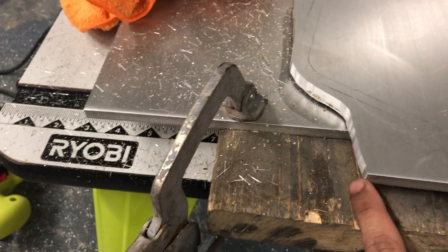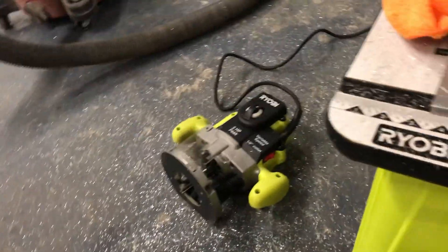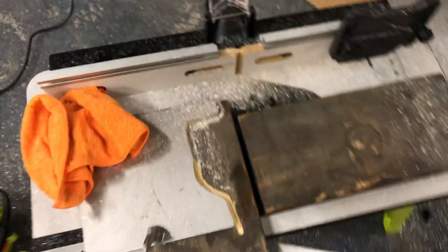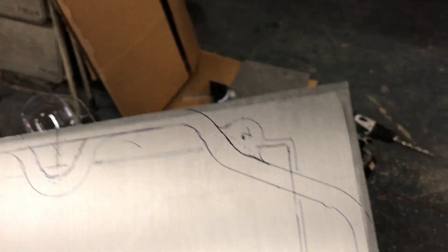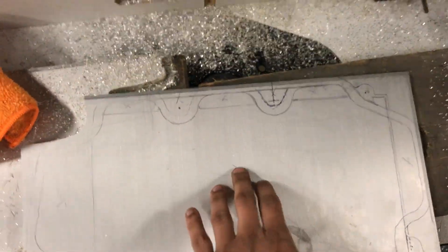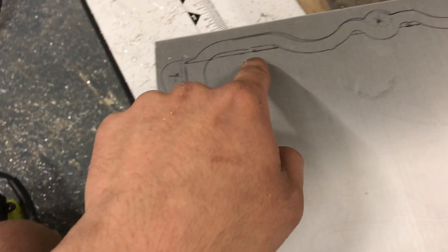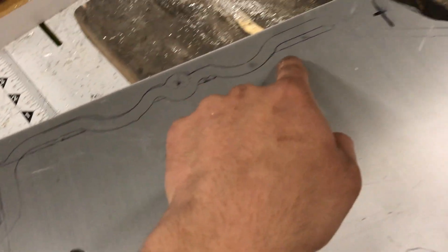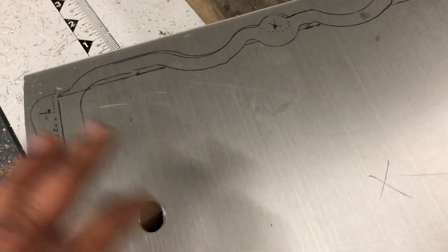Going at it slowly. After about an hour of cutting away level by level, I was able to preserve the bit — it didn't break — and we got our first shape out. Now we just have this section, which is basically what the spacer will be, three-eighths thick. I'll get the quick edges off and figure out a plan for the middle, since all that space is going to be cut out for airflow. I'll cut a big section out as safely as I can, staying inside the inside edges.